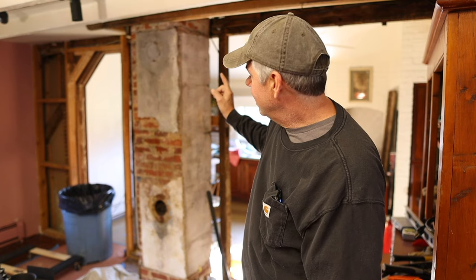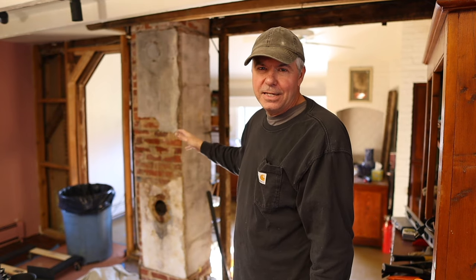The next step is to try and remove this plaster or parging from the chimney and expose the bricks. I'm going to take my little bar and hammer and chisel it out, break it out. Hopefully it'll come off — I've done a few pieces where it's come off in chunks, so that should be pretty easy. Then we should be ready to move on to the hearth project, which is not going to be as intense as I once thought.